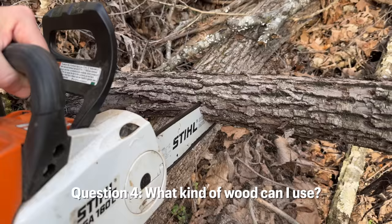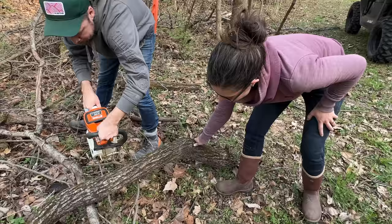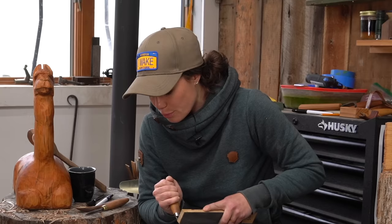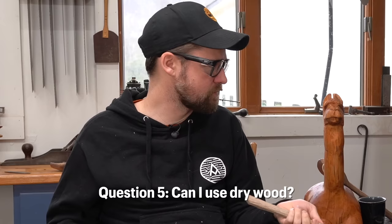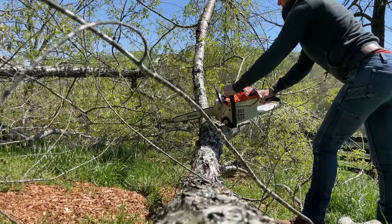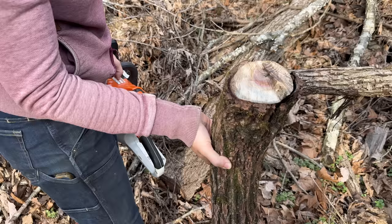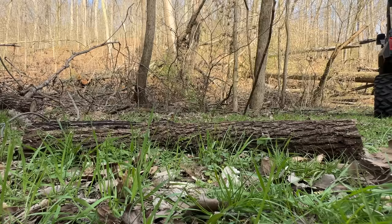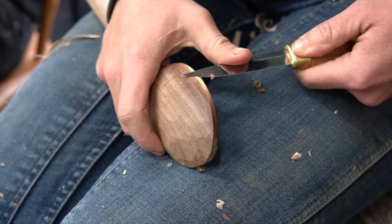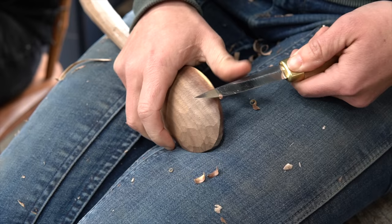So what kind of wood can I use to carve a spoon? You want to use fruit and nut wood if you can, and very specifically we want to use green or freshly cut wood. I personally like to carve walnut and cherry best. You can totally carve spoons with dry wood, but green or freshly cut wood is a whole lot better because it's softer — it's still got all the water in it. It's a much more enjoyable experience for your hands, and it's safer because you're not having to exert as much pressure, and pressure is where things get out of control.